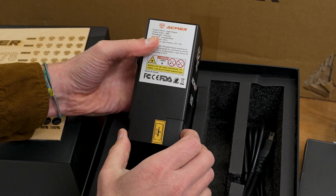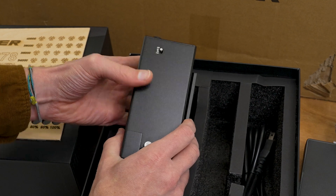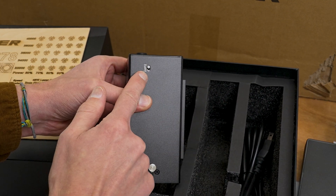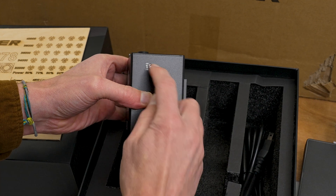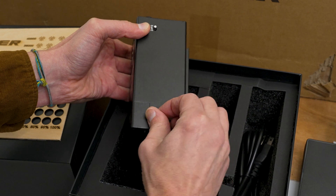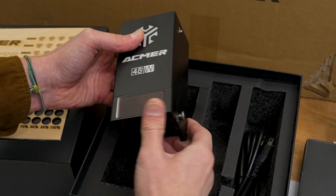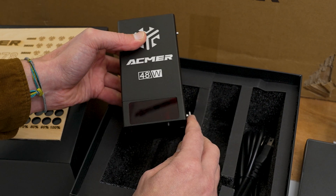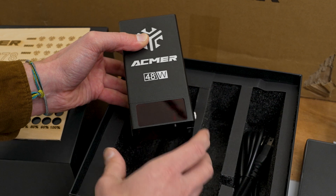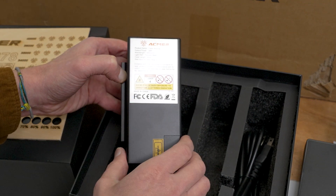This thing is pretty massive and has a nice weight to it. The case is all metal, and this one is switchable between 48 and 24 watts. Inside there's a depth gauge — I believe this is for pre-setting. If I'm going through thicker materials, we typically set the focus a little bit closer to the material, setting the focus in the material to get a cleaner, deeper cut.